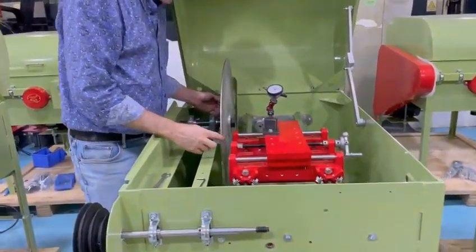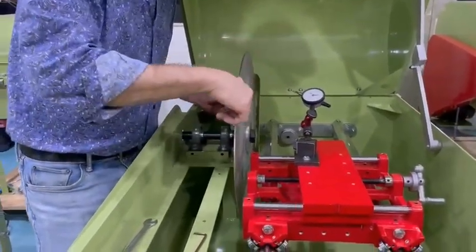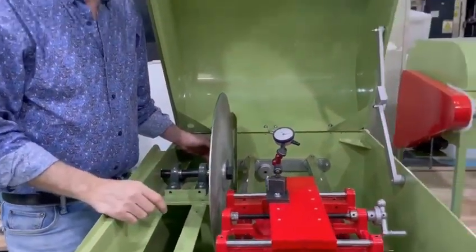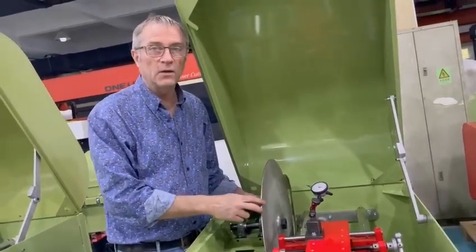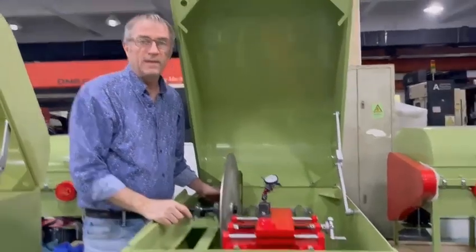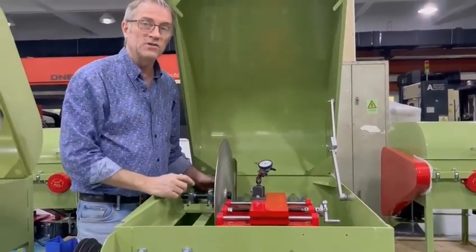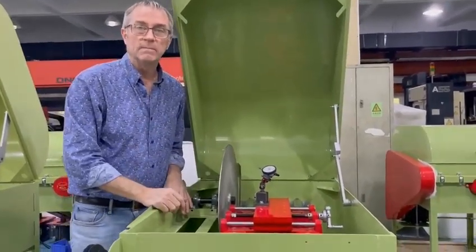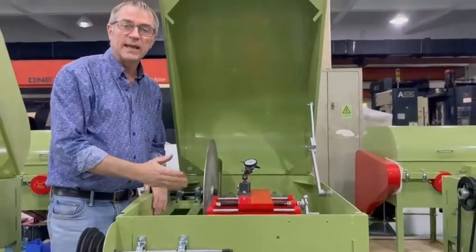If your arbor is out of alignment in the other direction, it starts cutting and as you go, the rock starts pressing into the inside of the blade. You're not going to get a parallel slab and you're going to destroy the blade after very little use. If you run a saw where the arbor is not aligned, it will destroy the blade very fast. You can put a brand new perfect blade on a bad arbor, or if the arbor bearings are bad — where it allows the blade to move front to back — the alignment is constantly changing, and you're going to see that blade has changed engagement in the rock.